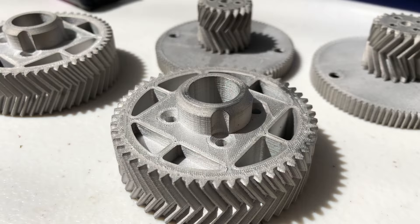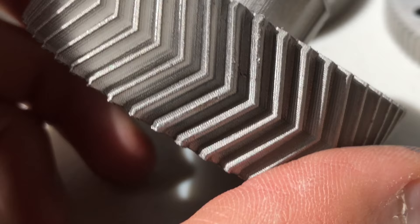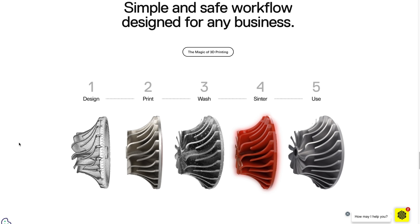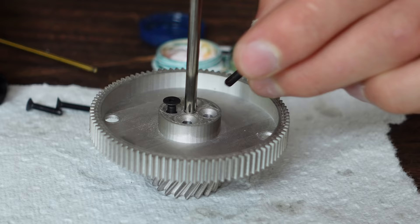This obviously isn't plan of record for the kit version, but I thought it would be super fun to try out. They're made of solid tool steel. These things are so dense and heavy — it's legitimate steel. This is my first time seeing metal 3D printed parts and I was super impressed. The metal filament is FDM printed and then it's sintered later, so they still have all the little lines and ridges like normal FDM printers create. I was trying to tap holes in the steel for bolts and it is super tough — I broke a tap in the process. All the gears for one vehicle weigh 1.2 pounds.